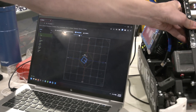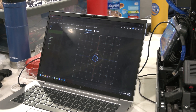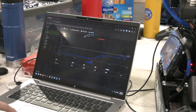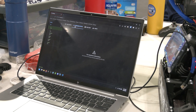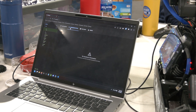For example, we can see the robot movement as it's moving around the field — this is just showing odometry. We can graph values, which helps a lot for PID, so as the robot moves around you can see the values pop up and down. It also allows us to view log values and hardware statuses — we can see if things are disconnecting or reconnecting randomly throughout the match, which can happen if you have bad cables.